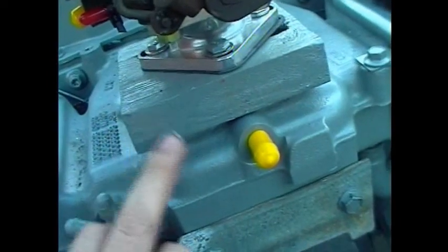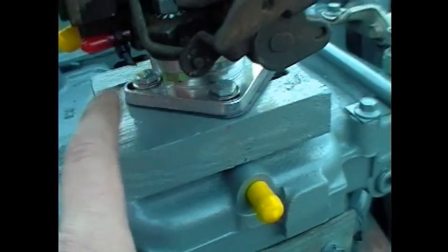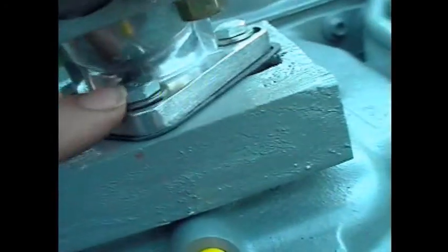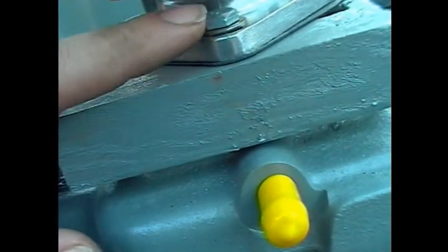The way we adapted the 1-barrel intake to the carburetor is we used, I think it's a 1x6 piece of wood, painted the crap out of it so it wouldn't rot. This does work. I've actually read about people doing this on race cars to isolate the carburetor from the heat of the motor. And then we used a 2-to-1 barrel. These are bolts. These are not wood screws. These are bolts held in with basically a wood helicoil. Essentially, you can buy these at Home Depot.